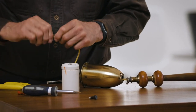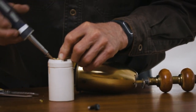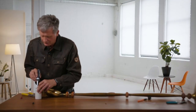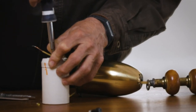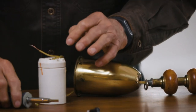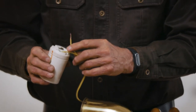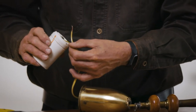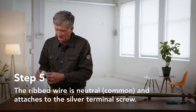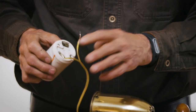Twist the left wire and wrap it around like that. Use my screwdriver to assist a little bit. Tighten it down. Make sure there are no frayed or loose wires on there. Now this wire right here — it's ribbed. It could be ribbed, it could have numbers or labels on it, it could be silver. That's going to indicate your common side. And your common side is going to go to the silver screw on your socket.